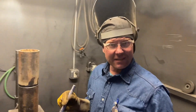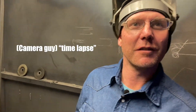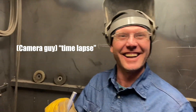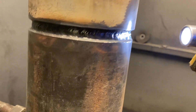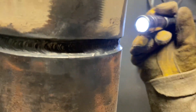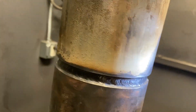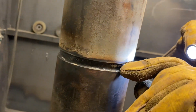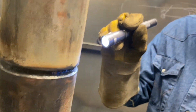That's probably the fastest hot pass you've ever seen — we had it in time-lapse. This is what it should come out like right here: nice and flat across the middle, nice and smooth, no slag, no undercut, ready to go. We're going to run a two-bead fill — a quick bead on the bottom, one on top — flush that out and get it set up for our cap.